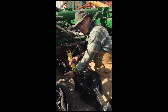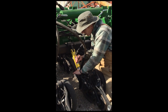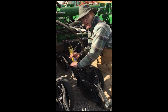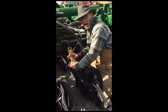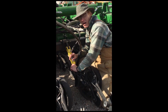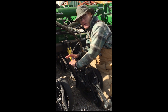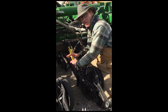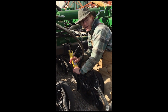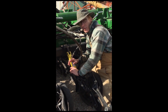Meanwhile, other openers are going up over slight rises in the terrain. No field is laser level. Those springs are putting down way more pressure on the opener. For instance, maybe you're trying to put 500 pounds down. The springs that have relaxed a little are only putting 200 or 300 pounds on, or maybe none. The other springs that have compressed even further are putting on perhaps 700 or 800 pounds of pressure, which is doing you no good. Meanwhile, the ones with too little pressure are not holding depth, and you may have stands fail because you're not getting the moisture.